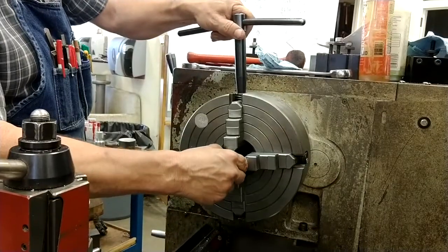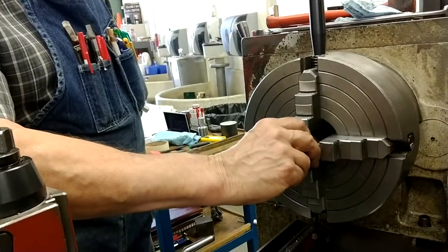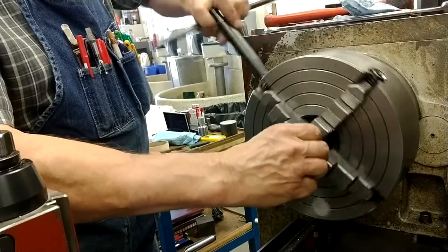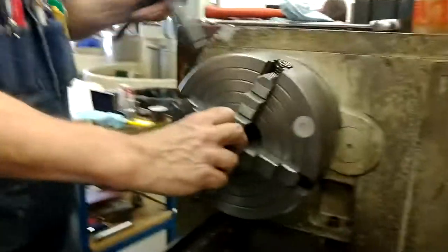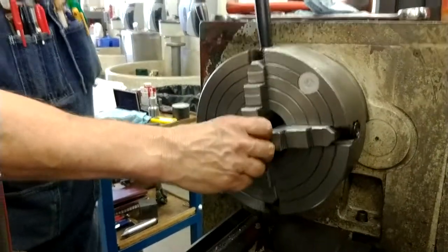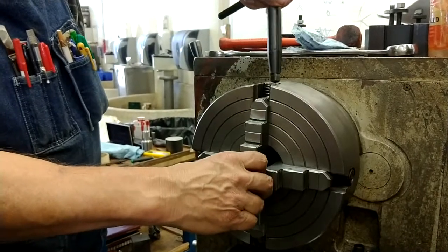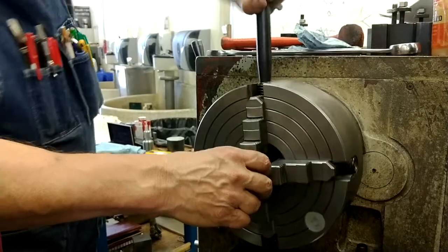And you're going to true it up. It's a little bit trickier than the collet, because the collet will true the whole thing up very nicely. But you only do that if everybody else has gotten the collet chucks before you. You can do this. Then you true it up in a four-jaw.